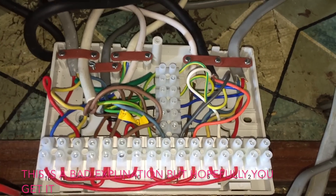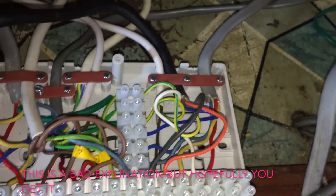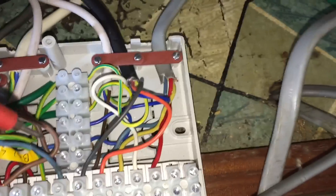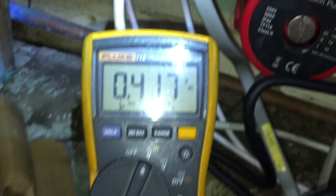So if you have a hot water issue, the only thing it could be is mechanically the valve is jammed, or the valve has failed and you've constantly got 240V on the grey. But in normal operation, the three-port doesn't do anything electrically for hot water to work. Anyway, got the heating on now. Start with something you know — the three-port should have 240V on the white wire.